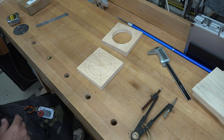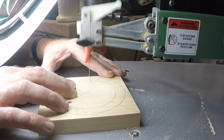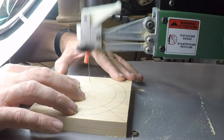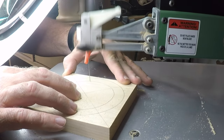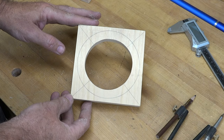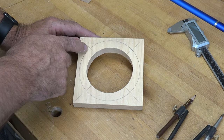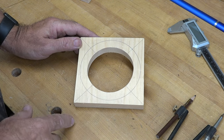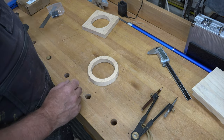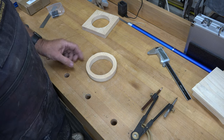For this cut I have installed a number seven reverse tooth blade. I've tilted my scroll saw blade at five degrees to the right, and we're going to cut out the interior hole — traced from our first piece — by cutting it in a counterclockwise direction. You end up with something like this. Without changing the orientation of your piece or the angle of the scroll saw, we then cut the perimeter counterclockwise as well, and what you end up with is this five-degree tapered ring. The top is actually the bottom, so we'll flip it around and it sits on top of our initial block.